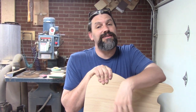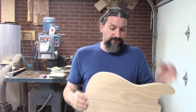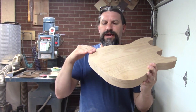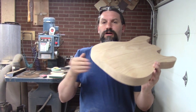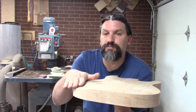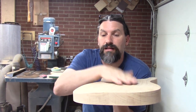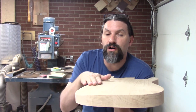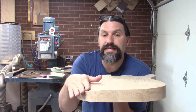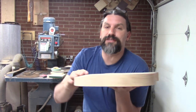Just going to need a lot of clamps. The first thing we want to do — we've got our body cut out and I have already radiused the forearm area. When you do this, you want to make sure that you have a nice smooth transition, not an angle. You want it to be nice and smooth, and you also want to make sure that it's flat so that your top bends evenly over the contour.